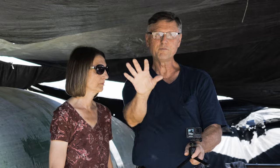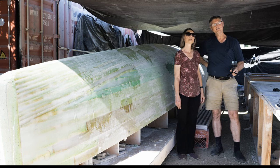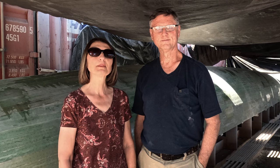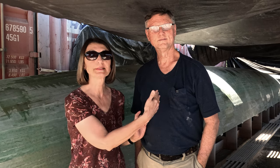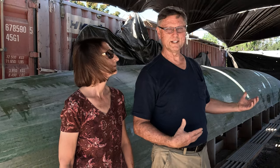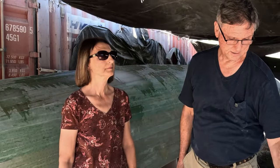There's also more space behind here where we can take some of the larger pieces from the orange container and walk them out and get them up on top. Another benefit is that the bulkheads can be placed earlier in the order they're supposed to be, because we don't have to take the heavy diesel engine down the center. Those major bulkheads span across these two hulls all the way down here. We were going to have to try to do the engine much earlier, which is not really the way it's supposed to be done in the plan. By reversing these around, we can put those major bulkheads in, and at worst we have to leave the last one out before we put the engine in. That's a big benefit.